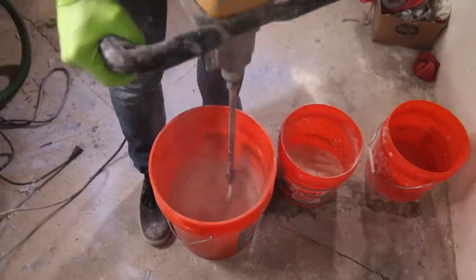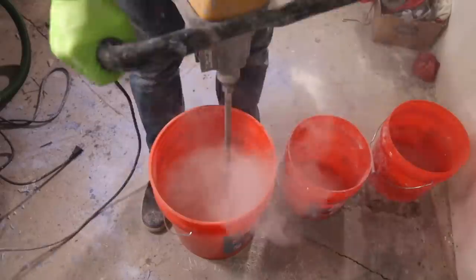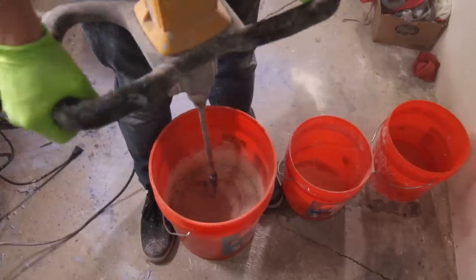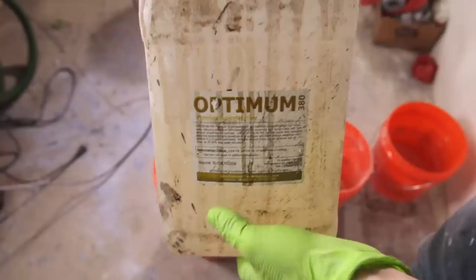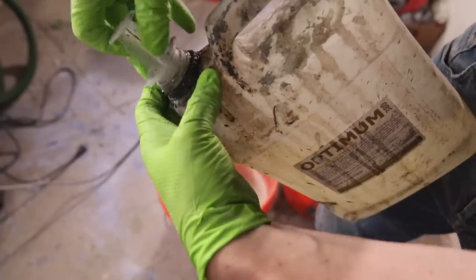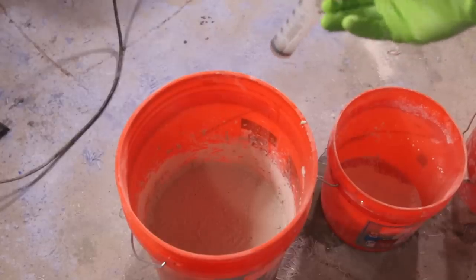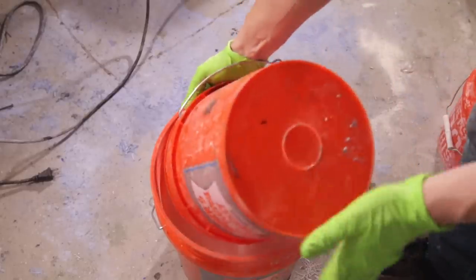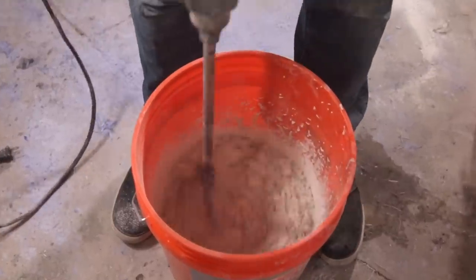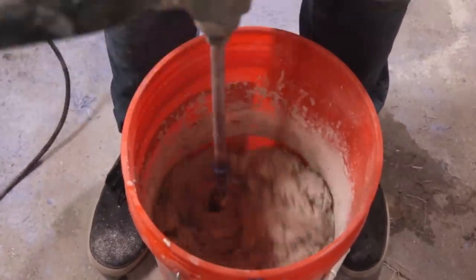I add about half the concrete and start mixing it up, gradually adding concrete and then a little more water if needed until I get it to the right consistency for the pour. This is optional because there is already a plasticizer in the GFRC bag mix, but I like to add a little more plasticizer just to make it really fluid. After putting in the last of the concrete mix, after about 10 or 15 seconds you can see the plasticizer kick in and the crumbly concrete becomes a fluid mix.